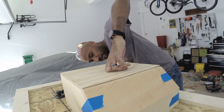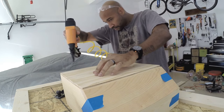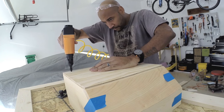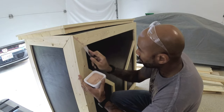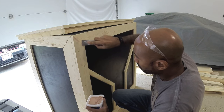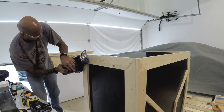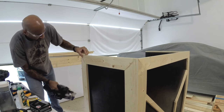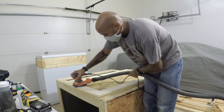Then back to work on the coffin top. This is the back piece — just thin plywood that I'm gluing and nailing on since it's all cosmetic. I hit all the edges, corners, gaps, and pinholes with wood filler. After I sanded and painted it, I wanted everything trim- and decorative-wise to look like one piece. I ended up cutting off edges on the back because after I test fit the lid, I realized opening it would hit that back corner.